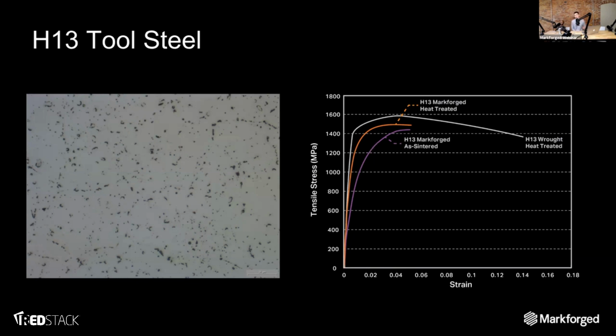It's hardenable through our established standards to 45 and theoretically up to 50 or 52. So it's a pretty hard material. It's not like A2 or D2, which you'll see up in the high 50s, maybe even the 60s range for Rockwell C hardness. But overall, it's a great material for injection molds, for wear tooling, for anything that needs a little bit more robust surface strength than 17-4. And so that's kind of where we're at on this.